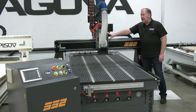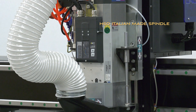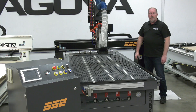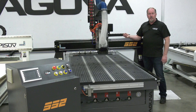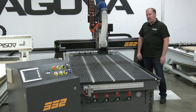The spindle is an Italian-made spindle by HSD and is considered to be one of the best spindles in the world. It's an automatic tool changing spindle. We use an eight-position bed-mounted tool rack at the rear of the machine to house your tools, using a standard ISO 30 tool holder cone to perform tool changes.